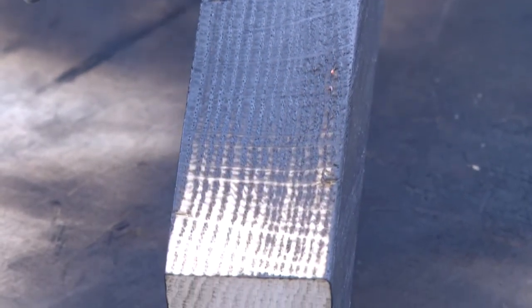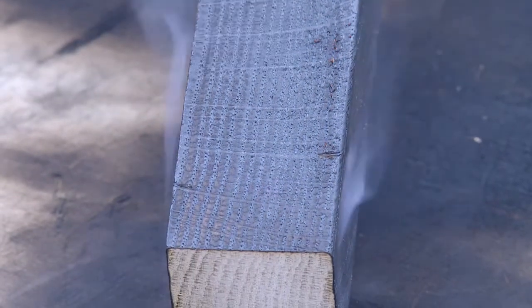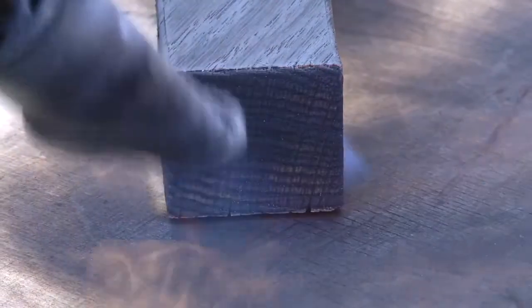As well as making it black, it also weatherproofs the oak, so it means you don't have to add any unnatural chemicals to it. It just becomes black and becomes its own timber treatment in a sense. Partly for contrast and partly for resistance to weather over time — so it's a kind of perfect finish, in a way.